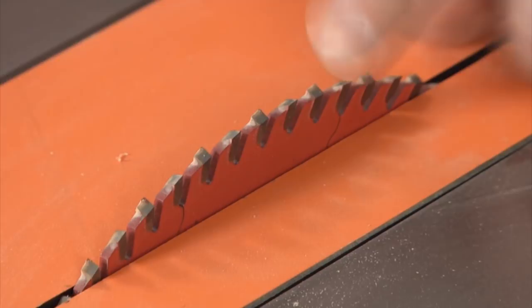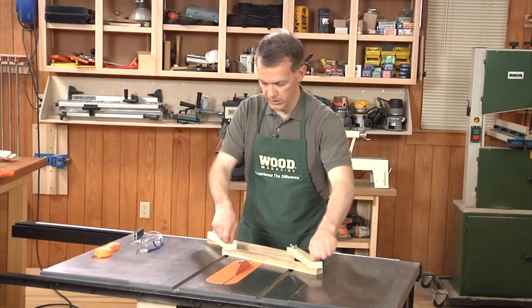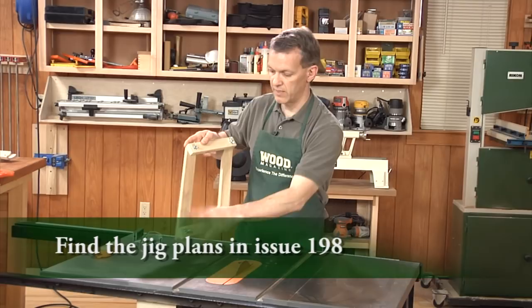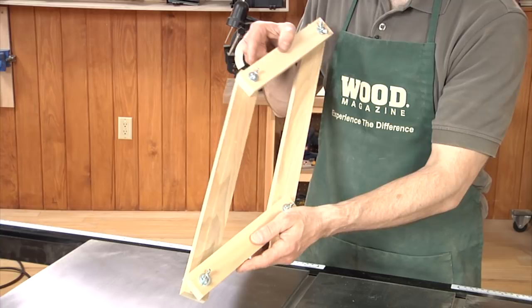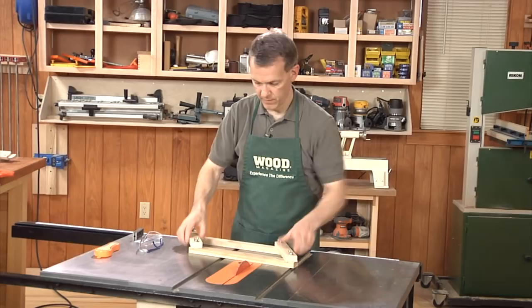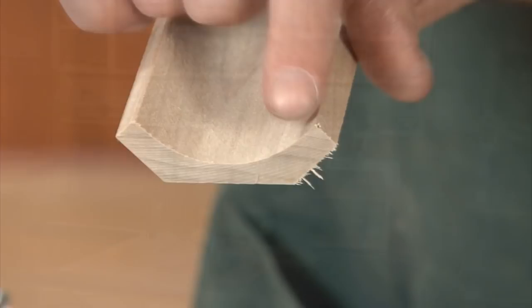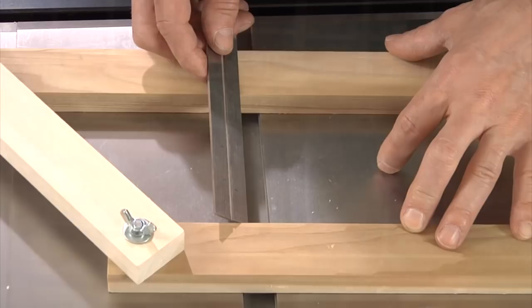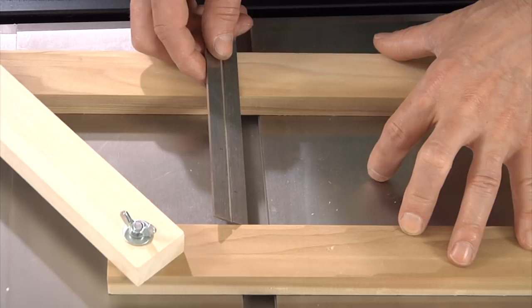You also need a little jig — simply a pivoting parallelogram. When you make it, it's really simple: opposite sides are the same length, drill the holes carefully so they're centered on the width, and assemble it carefully so that as you pivot the jig, the sides always stay parallel. You're going to take the dimensions of your cove — in our magazine article example, the cove was three and three-eighths inches wide. So set the arms three and three-eighths inches apart and lock the wing nuts at that width.